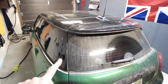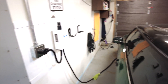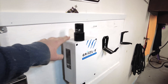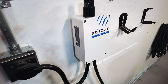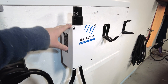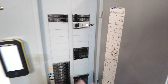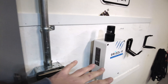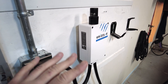This is our Mini Cooper. We're actually celebrating two years with it since we got our first EV. It's been absolutely fantastic and this is my garage — it's not very fancy, it's a work in progress. This is my EV charging setup at home, or my electric vehicle service equipment. Everyone calls these chargers but I wanted to get it right for the nerds out there. Two years ago I put this setup in. I bought a Grizzly Avalanche Edition — it's a dumb charger, no smart features whatsoever — and I installed it on a 50 amp breaker. The dip switch is set at 40 amps so I can do 9.6 kilowatts, and it's been relatively good for the last two years.